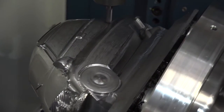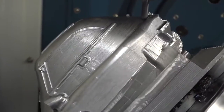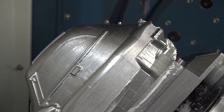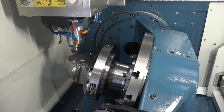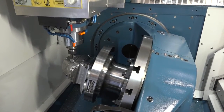And that's purely held on by a magnet? Yeah, it's permanent electric magnetism, so that will stay permanently magnetised until you reverse the polarity. They can also be interfaced with the machine, so if you wish to robot load, it can be interfaced with the machine. What happens when there's a power cut? It will stay permanently magnetised until you reverse the polarity. That's clever.